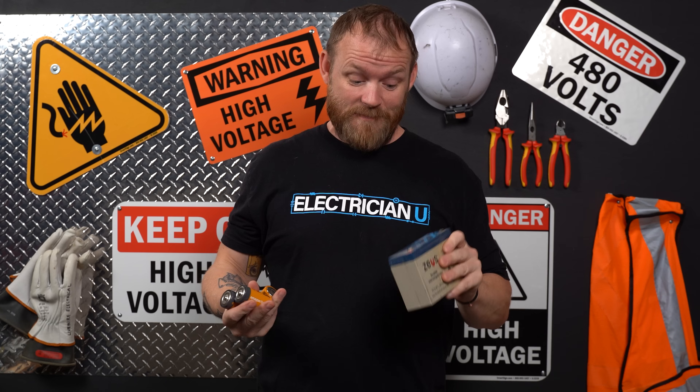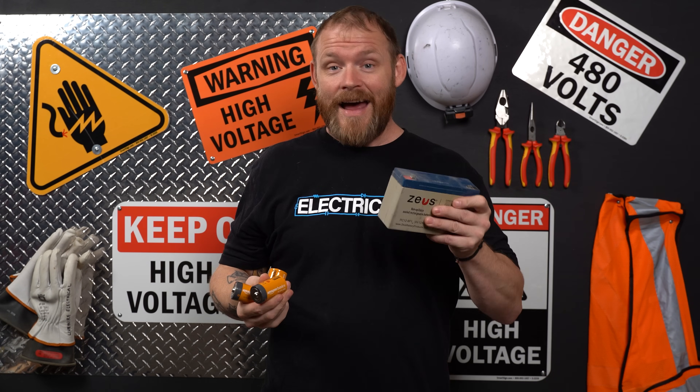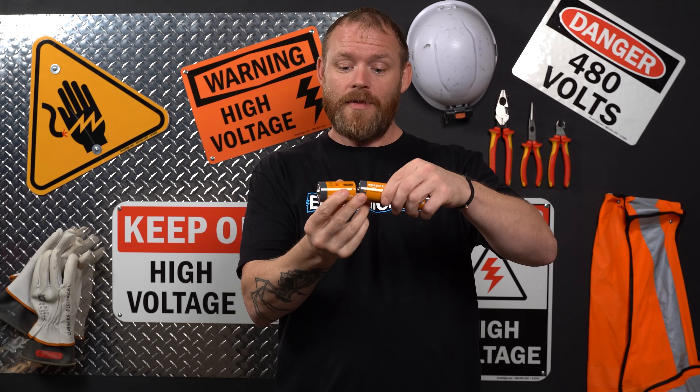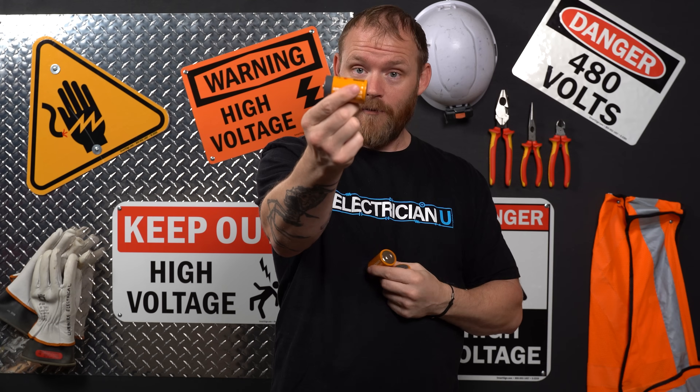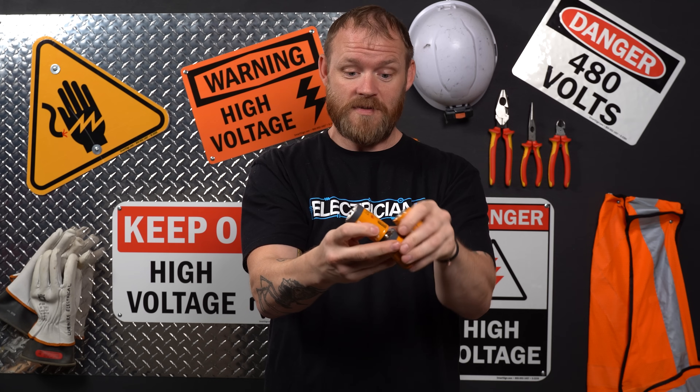A UPS on the inside is essentially just a whole bunch of batteries. Let's talk about handling batteries — batteries can be extremely dangerous. A lot of people think 'oh it's just a little battery,' but consider a D battery: it's only 1.5 volts but there's a lot of current capacity. If we take 3 D batteries and add them in series — positive to negative, positive to negative — we increase the voltage: 1.5V becomes 3V, then 4.5V. So in series you have the same current through the whole thing but you're increasing the voltage, which can be a lot more dangerous.